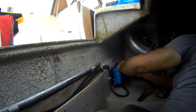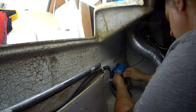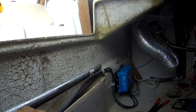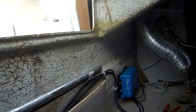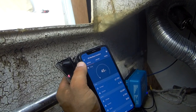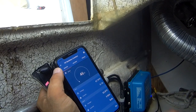It's rated to plus 60 degrees Celsius, so it's made for rough weather. This is an area that doesn't get rained on. Now I'm happy with the charge cables. This is the 150-volt 35-amp Victron Energy, and I am liking it. What I like most is the stats from the app. I have the Bluetooth dongle hanging off it. The sun's setting at 6 o'clock and the angle on these panels is brutal, but I still have enough volts that the battery is actually trying to charge right now.